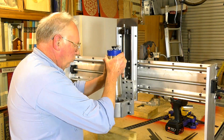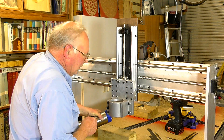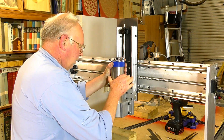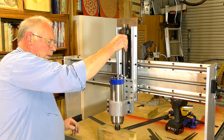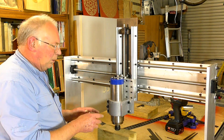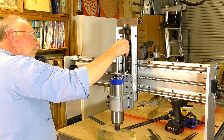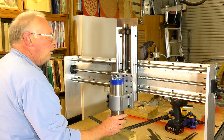So this is a 3 horsepower or 2.2 kilowatt motor. Not quite going to go in there - I can't hold it with one hand really. It's a sizeable motor. This is how I normally adjust my spindle in its housing, because it's adjustable by 125mm as well as what's in here. I'll take it about halfway, maybe a little more. Put those out the front - I think that'll be just fine there.